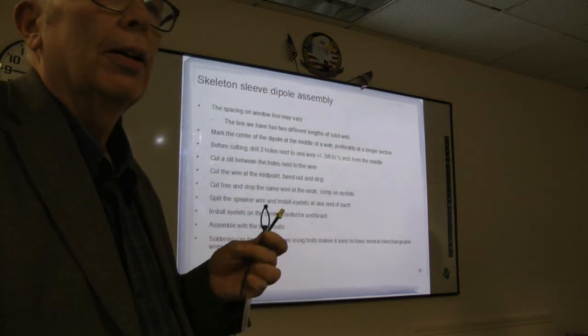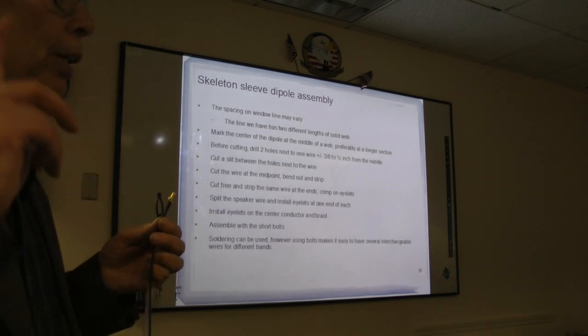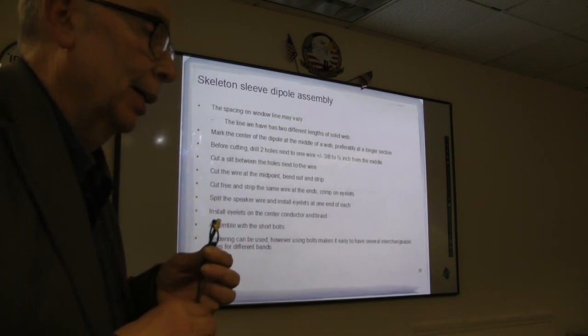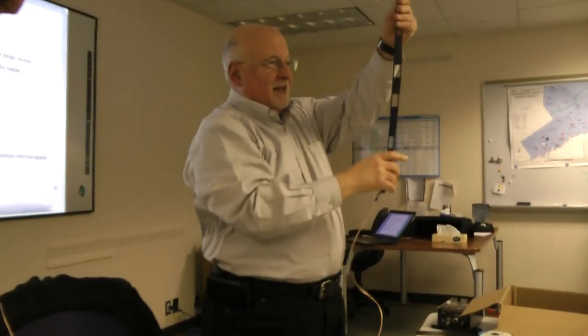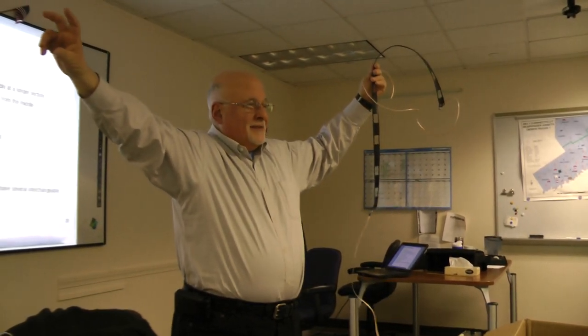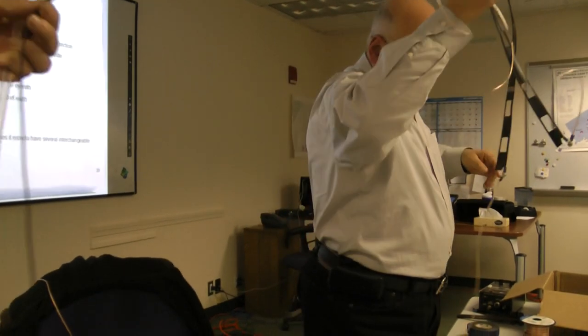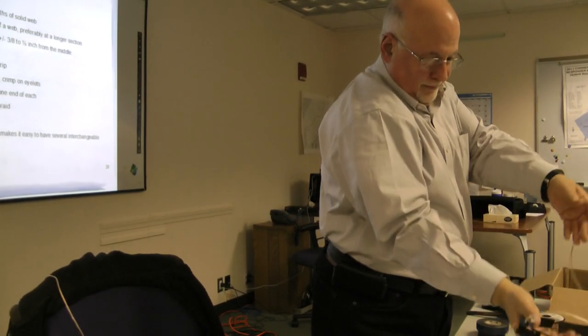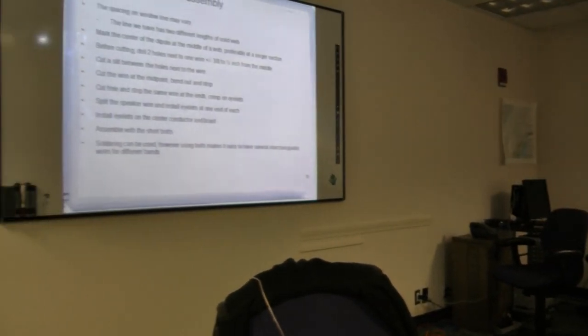Is it easier to build the dipole and use it vertically than the J-pole? No, it's not, because the problem is feeding. If you pull off straight from this, you have to come off straight for quite a while. That's why it's not easier. Well, it depends. There are circumstances where it can be easier. Here again, everything depends on the location.